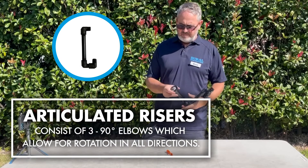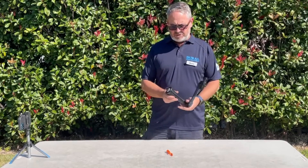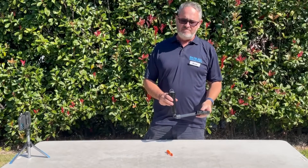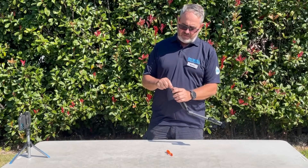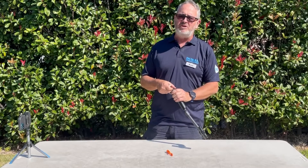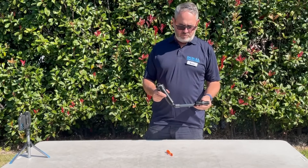When I first install it, we leave the grey flushing nozzle — which the sprinkler comes with when you buy it — in the ground. Put all the sprinklers in the ground, install the whole lot, then turn them on. When you first turn them on, the shaft will pop up a little bit and the water will come out flushing all the debris which might have got into the pipe. Then you turn the water off again.